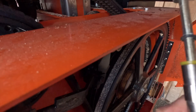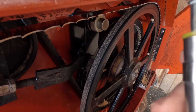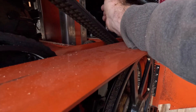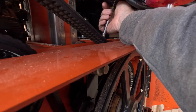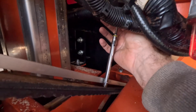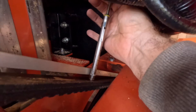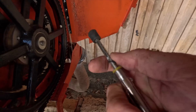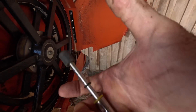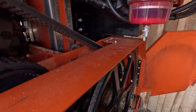When I come back, I want my little O-ring to be sitting right on that white mark — slightly under 15 pounds. Let's check it again. Straight down. You can see the deflection there, and you can see the O-ring. See how that works — you push it down, and once it gets to the right spot it's going to kind of grab and come up. My drive belt is tensioned correctly.